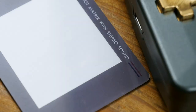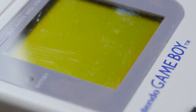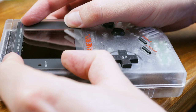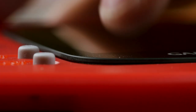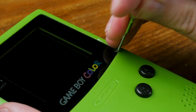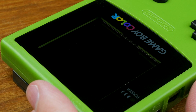The final piece is the self-adhesive screen cover, or lens. With the official Nintendo branding, these often look pretty close to official, which is great because most Game Boys could really stand to use a new screen cover. Typically a plastic one will come with most reproduction shells, but tempered glass lenses are also available. Tempered glass seems to get the most oohs and ahhs, but it can have some disadvantages. With the tempered glass screen cover I put on this GBA, there's a small imperfection in the lower left of the viewing window. On the other GBA, the tempered glass wouldn't even sit right, and on the Game Boy Color, I got a speck of dust underneath while applying the cover, and it cracked while trying to remove it.